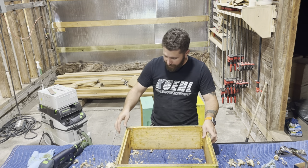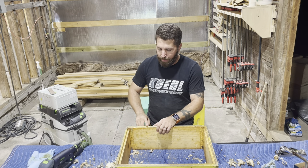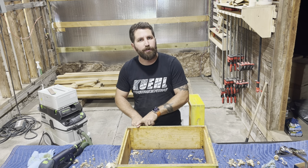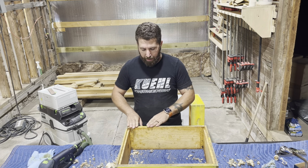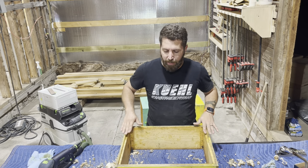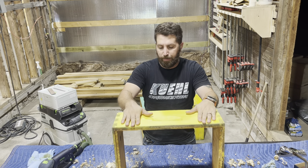First things first — you can see there's some paint here on the edge. I don't like it when paint comes up onto the joining edges because paint and paint stick together no matter how cured it is, so again the boxes get stuck. I like for these surfaces to be bare wood, and the inside to be bare wood. The outside should be painted because that's what's exposed to the elements.